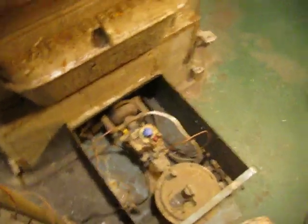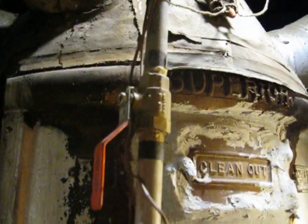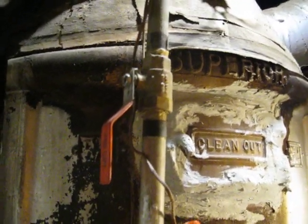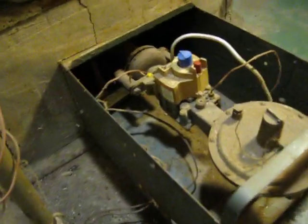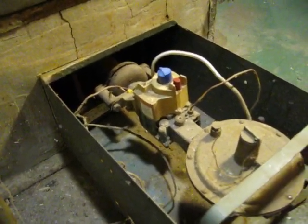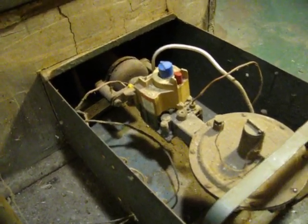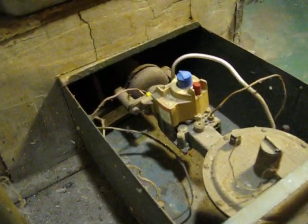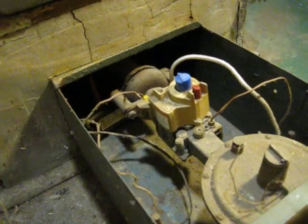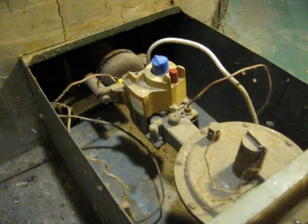Taking a closer look at what we're dealing with: we've got a big 3/4 inch gas line. Notice the valve is now open. That gives us our pressure regulator, then there's a Honeywell burner control. You can see that little silvery guy on the top — that bent silver, probably aluminum line coming out the top — that's the pilot line. Those two wires on the left go to that little high voltage igniter, which is the clicking noise. Apparently that always operates.